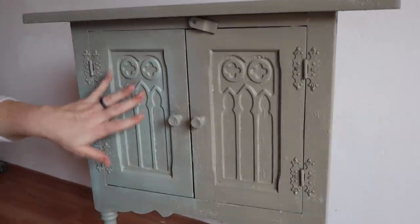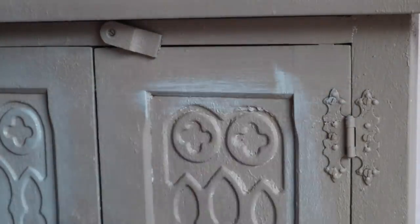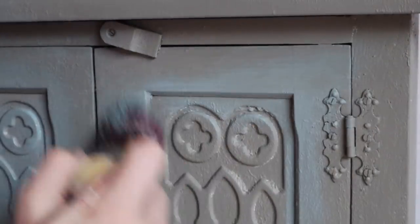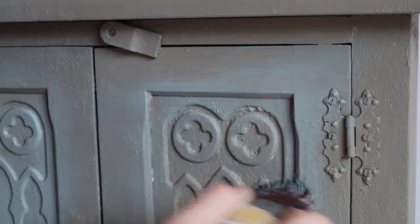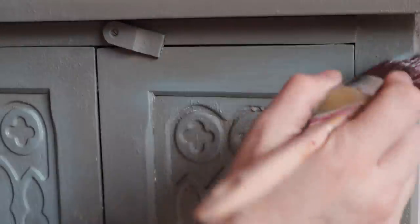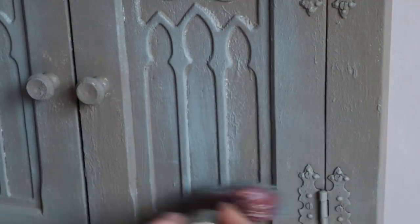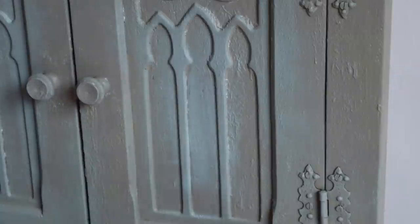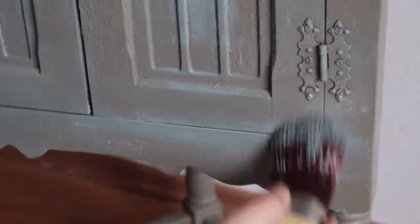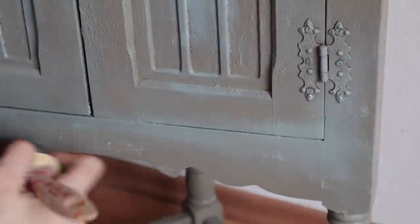Now I want to show you a dry blending technique. We're going to take Vintage Duck Egg and dip your brush into it, getting as much of the paint off as you can, then do a dry brush in certain areas — going in circles around the piece. This adds a layer of another color on top of the Spanish Moss. I didn't do it all over the piece — I did it in corners and other areas — and it doesn't have to be totally perfect because we are layering and texturing. A dry brush is exactly what it sounds like: the brush is dry, dipped just a little into paint with most of it wiped off.